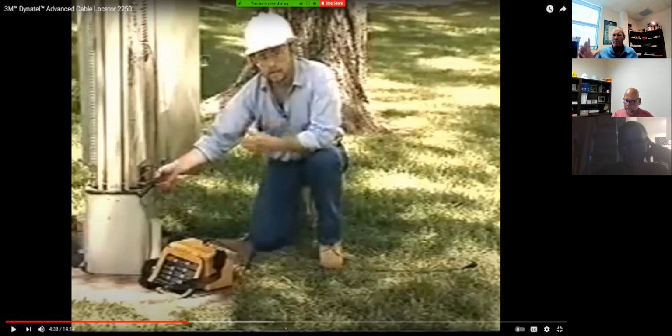Now, he goes through this pretty quick. But what he does in this connection method, and remember, we are in locating right now. We're not in fault finding. We just want to locate the cable in the dirt. And I'll give you this hint. Like out there at our field, when we went from the dip pole to the first switch gear, what was our suspected cable path?